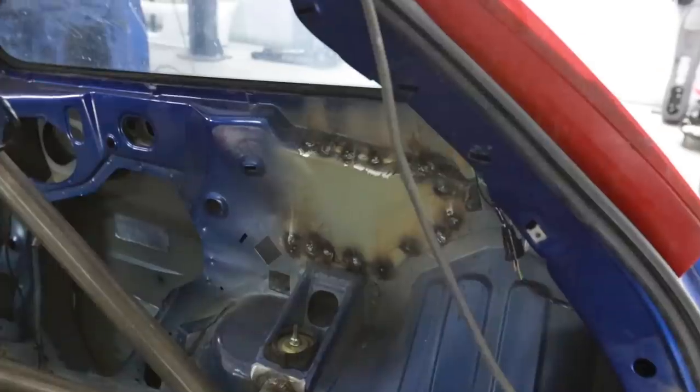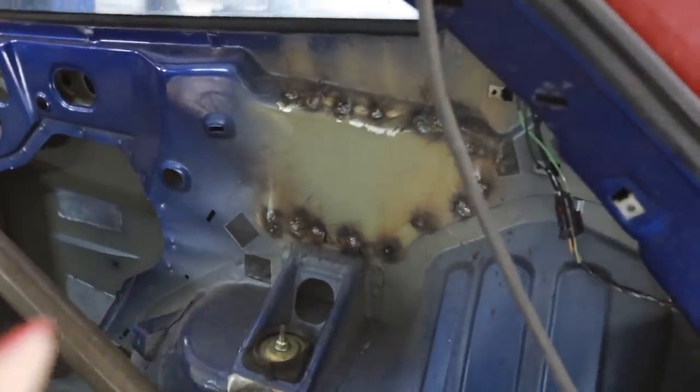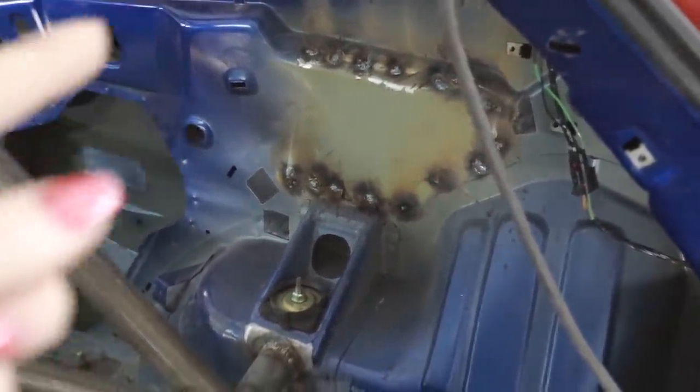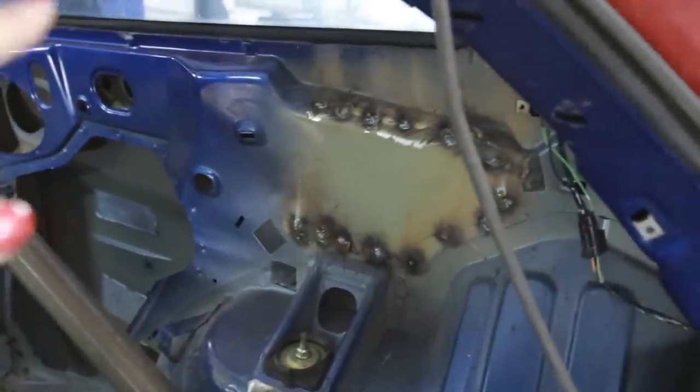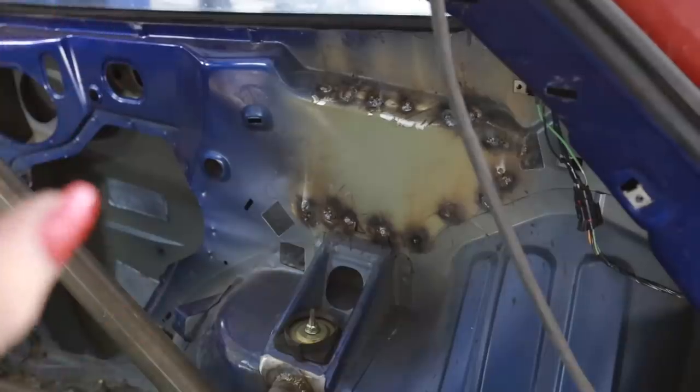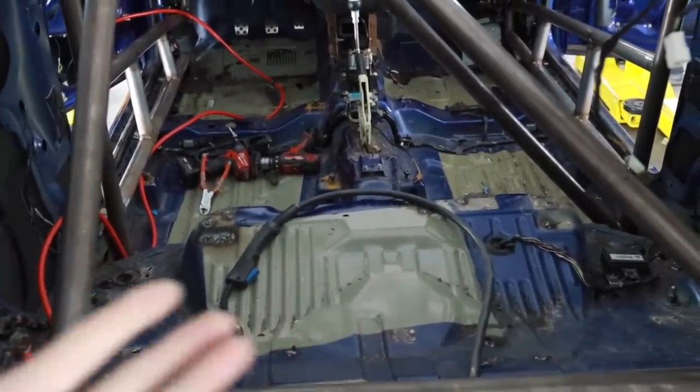Here, I'll show you. These were from the very first time I welded, and something Fred pointed out to me is that before I get going and welding everything up in here, I should do an area and then grind all those welds off that area so that area is done and it won't be such a daunting task when I'm all done and I have a billion welds everywhere that need to be ground. I definitely appreciate good workflow, so that made sense to me.